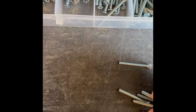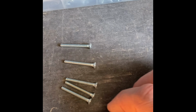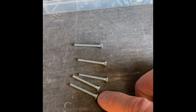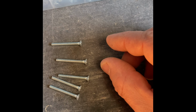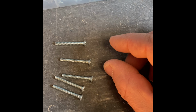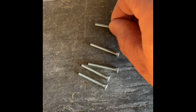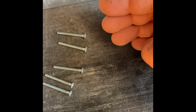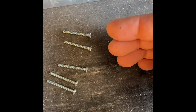when you go to put the screws back in the outlets, you're not going to want to suck the outlets all the way up to the tile, because your outlet screws are going to protrude basically into the tile once you put the face plates on. So you're going to just back it off slightly so that the outlet is allowed to kind of suck into the plate a little bit.